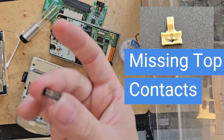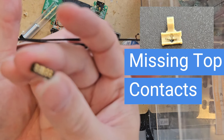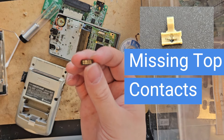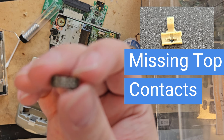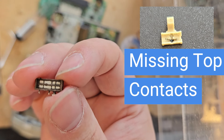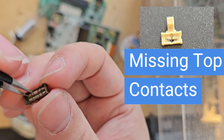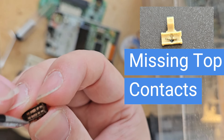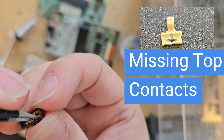To give a better representation of how a Game Boy Color switch operates, I salvaged the original model. You can see that the switch has two layers and is separated into four quadrants. My tweezers will act as the metal contacts found in the picture depicted. The tweezers make constant contact on the first two pads, grounding it, but when you slide it up, the console has constant power.